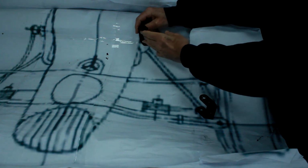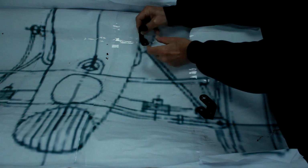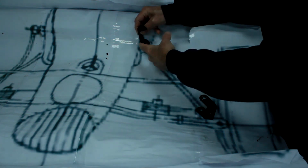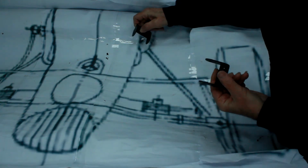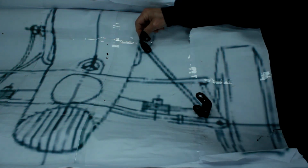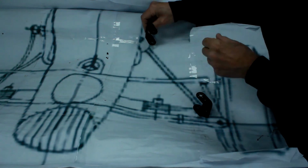I can put a tube through the middle. They are stainless, so they should weld, that you could weld a tube in and put a bolt through top to bottom, and it would give a bit of strength to the whole thing. And if that is not sufficient, it can be boxed in on that or that side elevation. So I'm hoping they'll be okay. We'll see. I'll work with them as they are to start with, and if they then show any sign of deflection or bending, we'll just go back to the drawing board and either redesign or alter these to suit.